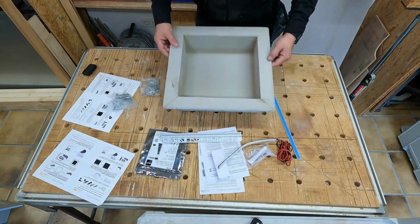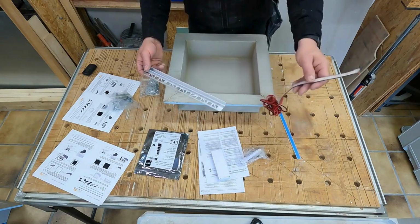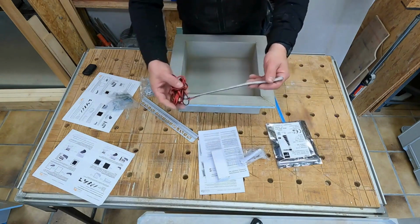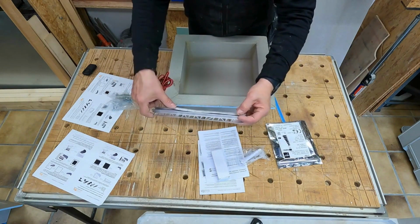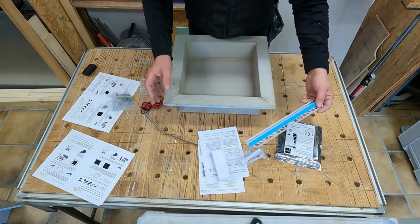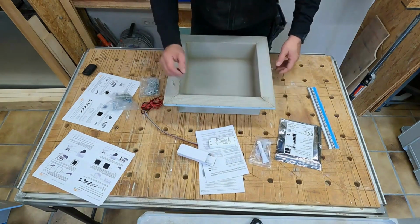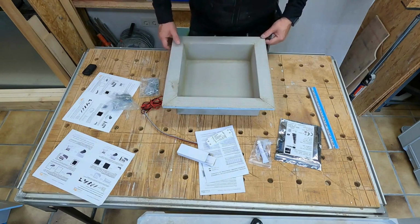If you want the whole thing illuminated, you can also order an LED lighting. Additionally, I'll show that briefly. This is what it looks like. Suitable for damp rooms, IP68, a flexible LED strip, which is mounted in the track here and then covered with a cover. But we will cover that in a separate video. The whole thing is also transformer operated. Of course, everything necessary is included with the mounting materials. I will make a separate video about that for you.